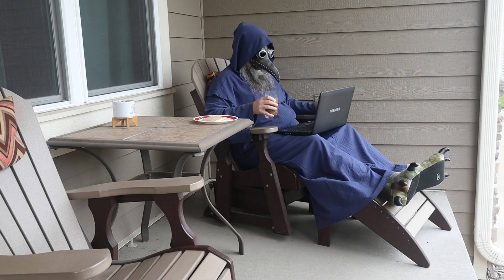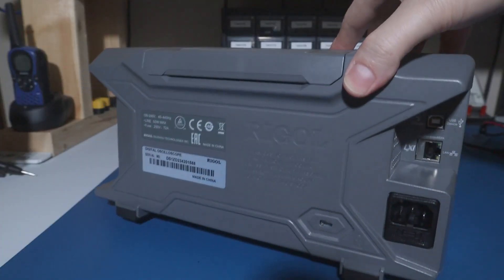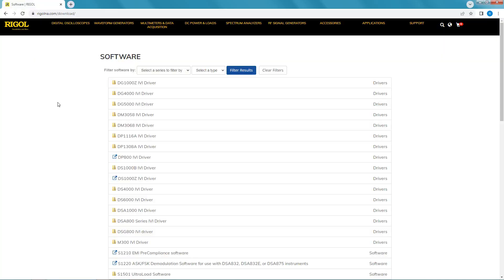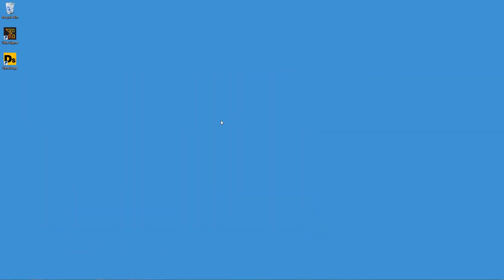That's pretty sweet. Now if we have a circuit that we're trying to monitor, we can do it remotely from another location — just connect the scope to a router and then you can go out on the porch to have lunch while watching the scope on your laptop. Fantastic! Now let's move on to the Rigol. You can control it from the ethernet port on the back. Unlike the Tektronix scope which has everything built in and lets you access it from an IP address, the Rigol looks like it requires you to install some software. First, you go to the Rigol website and find the Ultra Sigma instrument connectivity driver and the UltraScope remote interface and control software. The driver is used for the computer to talk to the scope, and the control software does the rest.